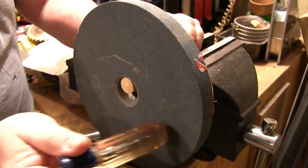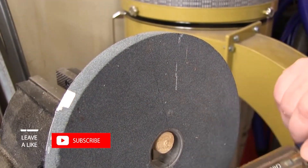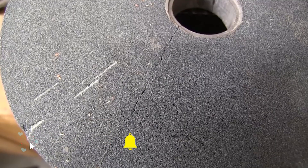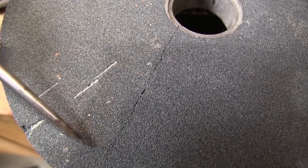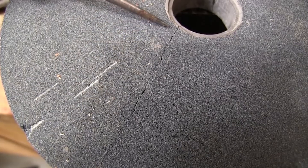No crack. With a crack. And here's the crack that's stopping those sound waves from radiating around the stone to produce the ring. Add one crack to it and that ring goes away completely — the sound is very dead.